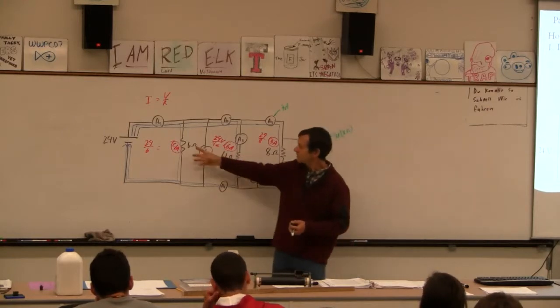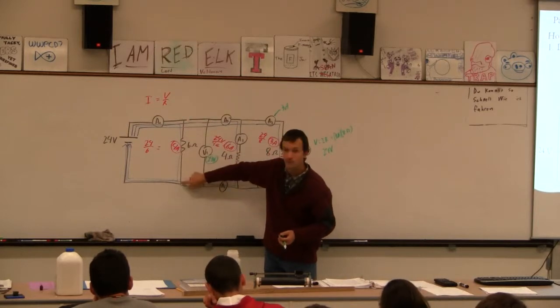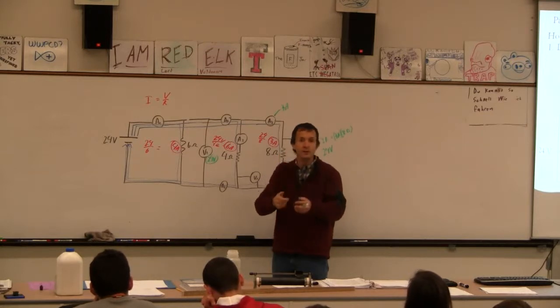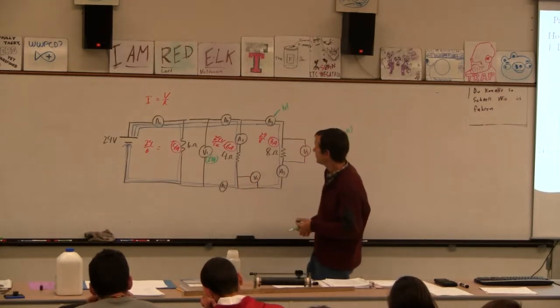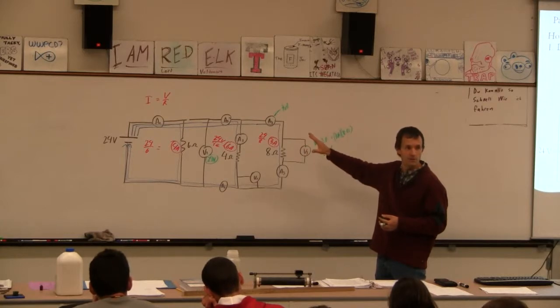So when you look at the socket there, this side is maybe the little plug, and that's the big plug or something like that. If you notice, the little slots are different sizes, right? And that's what it is. You're just hooking it up. Everything's in parallel. When you plug it in, you're plugging in a parallel load. Okay? So the more parallel loads you have, the more current flows.